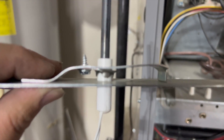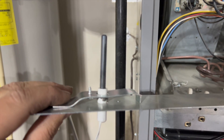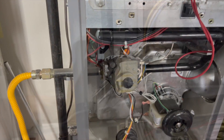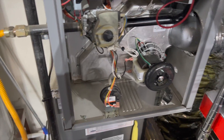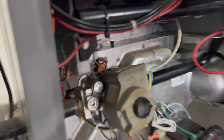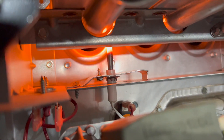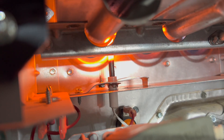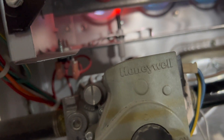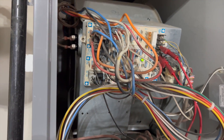What I came up with is a riser, which makes it just a hair taller than the original — but that should be enough to get it to ignite. Now we got it assembled, let's try this again. We'll just make sure the whole cycle completes, then we'll go change the filter and call it a day.